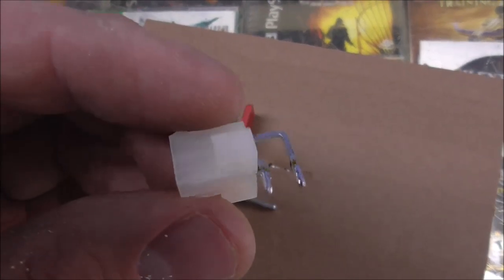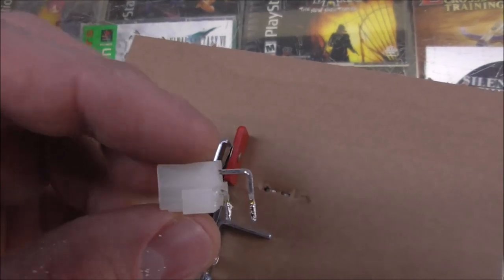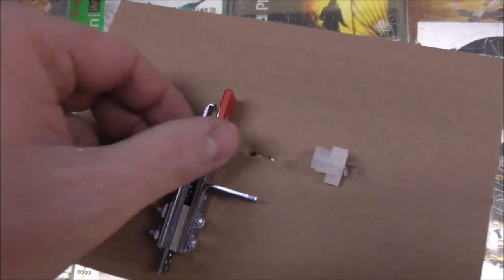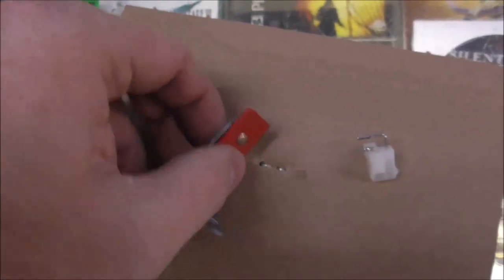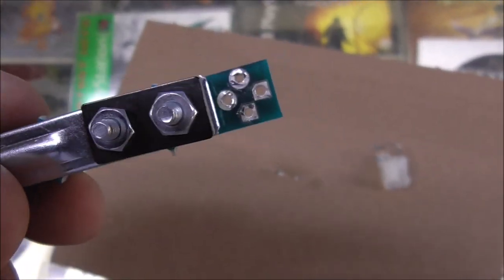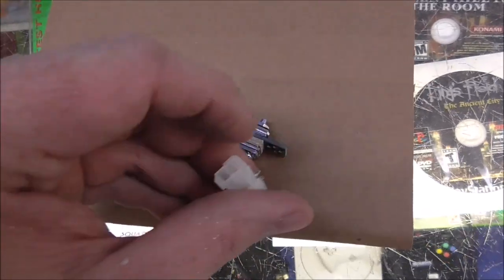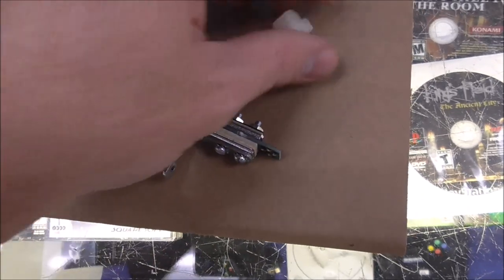They come with a little connector on them, but whenever they changed them out to make them regular switches, they took the connector off the wires. So I can't just plug it in, and this is a strange one, so I don't have any of these. What you can do is take the connector off and clean out those holes. Two of them connect together and the other two connect together. They did it like that because sometimes this mounts this way or just different ways.